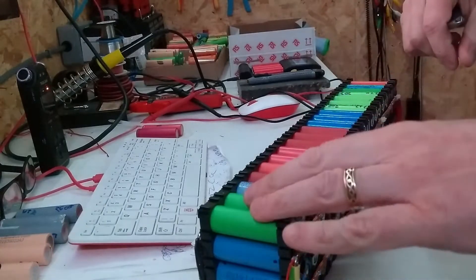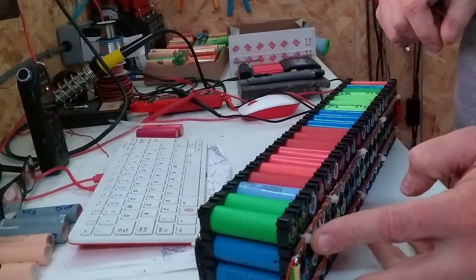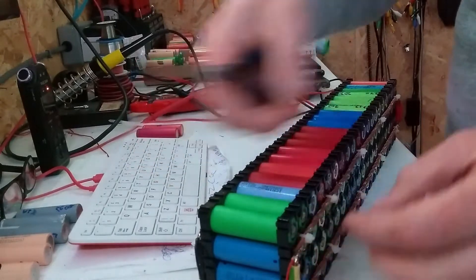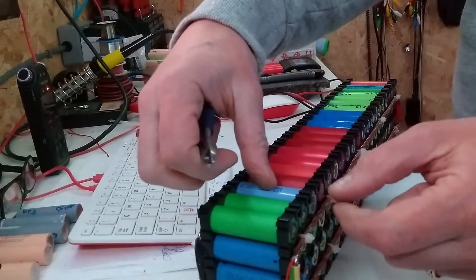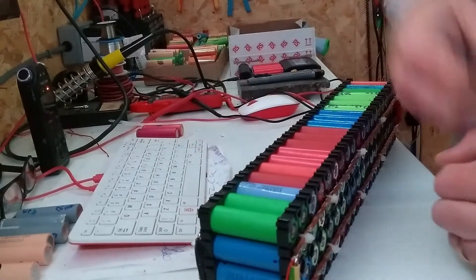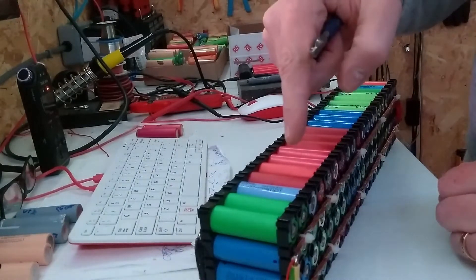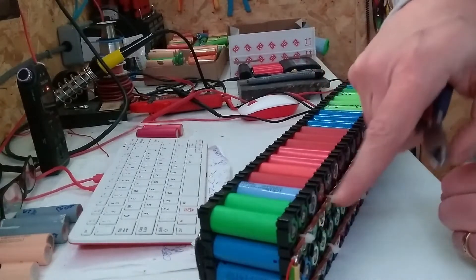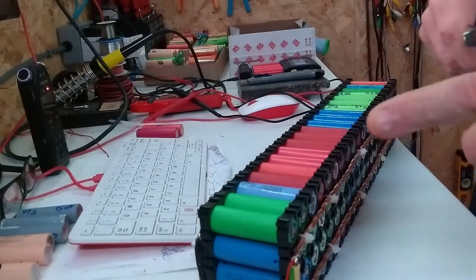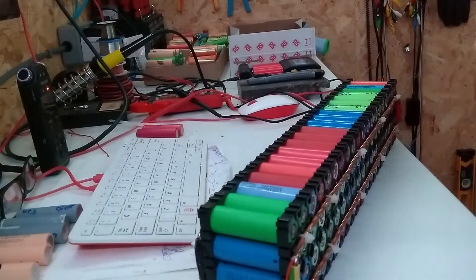In order to get these out, I'm going to cut these cable ties which hold the bus bar down and also hold the pack together. Once those are out I should be able to prise these apart just enough to slip these three out and slip the three replacements in on both sides. Then I can put fresh cable ties back in, re-solder the fuse wires, and put it back into service. So first thing to do is to cut the fuse wires on these three cells and these three cells, and then cut those cable ties.